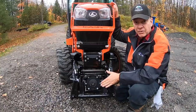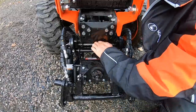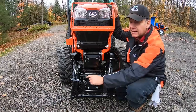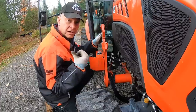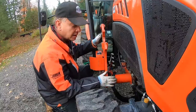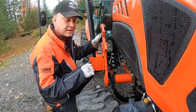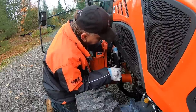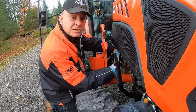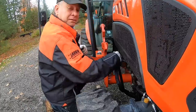That rain's coming in fast — we better get a move on. Before attempting to connect your snowblower, this big lever on the top you're supposed to push all the way back. By pulling it forward, it somehow secures the K-Connect into the female end of the blower. Before approaching your snowblower, you want to hook up your first two hydraulic hoses because that'll give you up and down, and you're probably going to need those to align into the back of that hitch. It's the top hoses — the white and the yellow — that do your up and down.